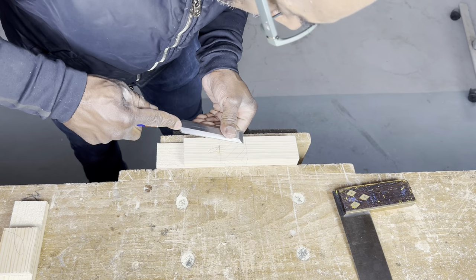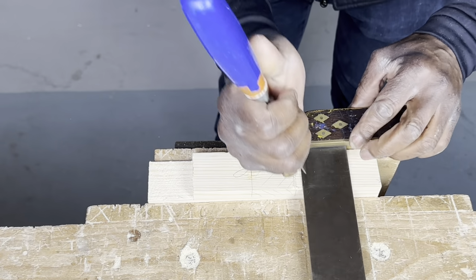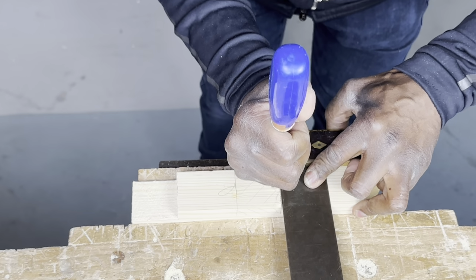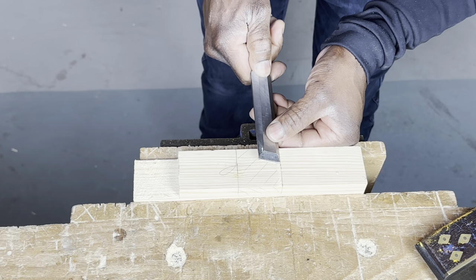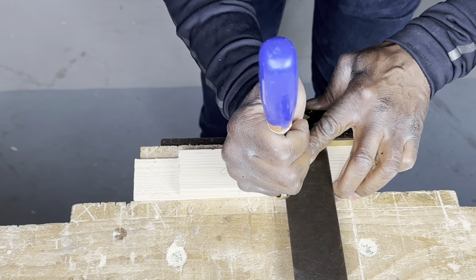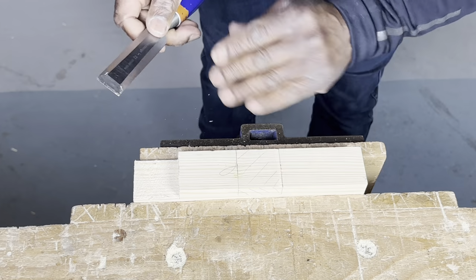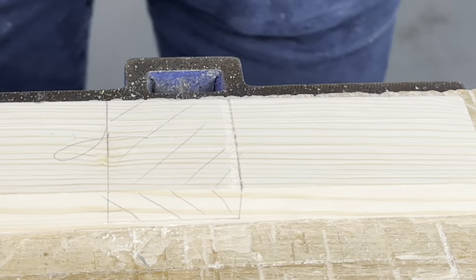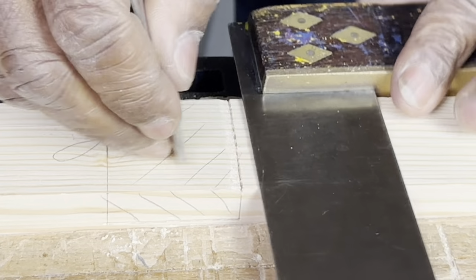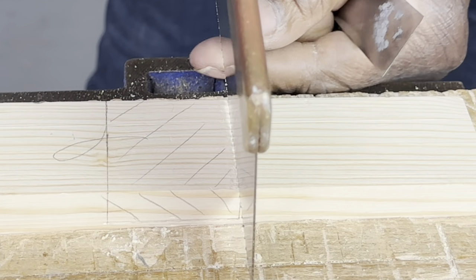Then I'm going to tilt that into there like this. What that does is it just gives the saw a guide. Still using my thumb in this one, just to show you another way of taking this out. I'm going to do the same here. So now I've scored along there, took the chisel inward, and then as you saw me, score this out and take this surplus away, ready for my saw. This saw is going to sit in there like that.